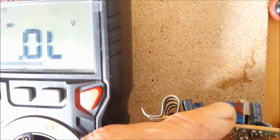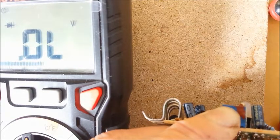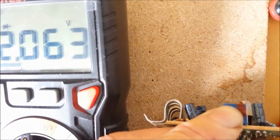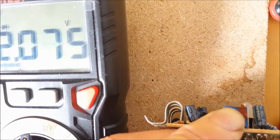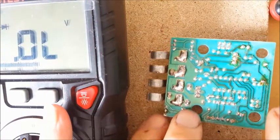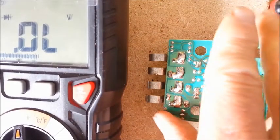So that LED seems to be working. If I just do it the other way, I also get a voltage drop of 1.8, but that's in circuit. If I take it out of circuit, then you get open circuit and you get a voltage drop closer to 0.7. So the LED seems to be working.